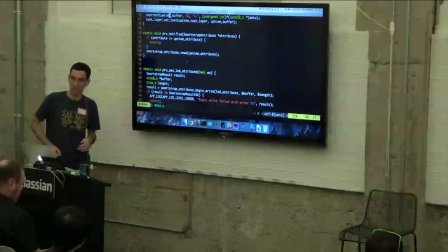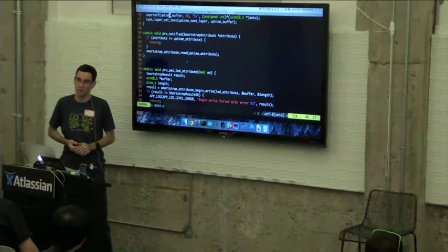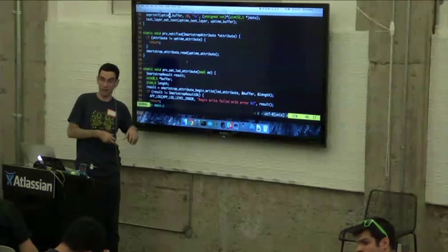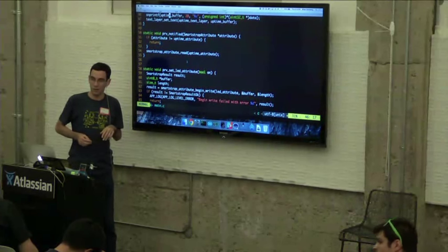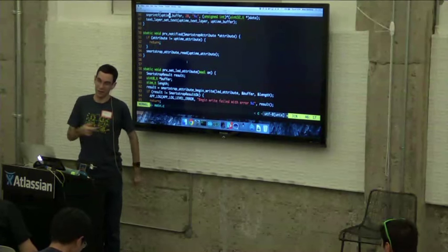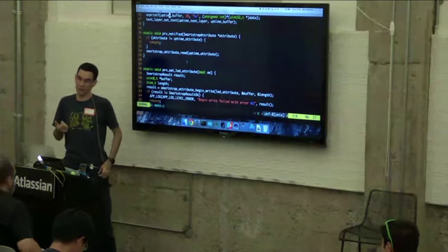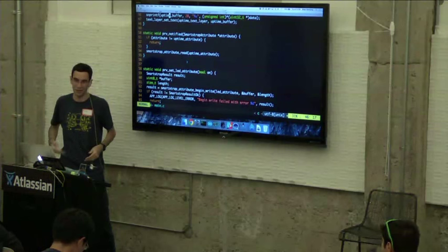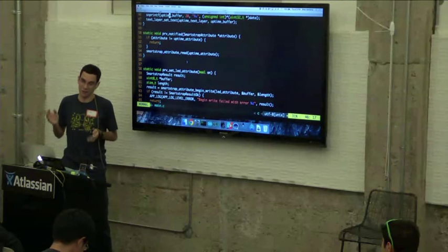Right, so the question is, unless the slave, in this case the Smartstrap, is sending a notification to the watch, there's no data going back and forth for this attribute, which is true. Oh, how do we actually support that notification mechanism? So what we do is UART has this concept of a break character, which is essentially just 0 bytes with an extra 0 at the end. So on the watch, it looks like a 0 with a framing error. And we interpret that as sort of this notification interrupt.